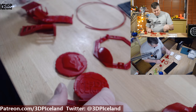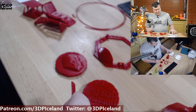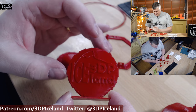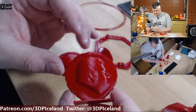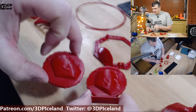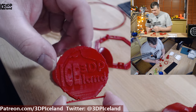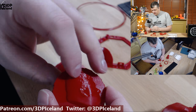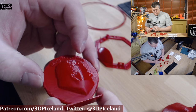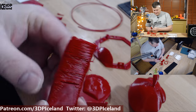At the slower speeds the print quality was coming together very well — it's a flexible or semi-flexible material and it was in the end working quite well for me. It took a while to find out that even though the label says it prints like PLA, it absolutely does not. You have to slow it down quite a bit to get good print quality. That was a learning curve for me, and that's a great use case for MakerBox samples — learning something new. I've never printed in a semi-flex material before, and slowing down the print speed was a new experience.